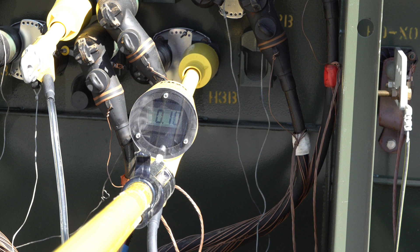If the reading on the meter were to oscillate between a high and a low reading, this would indicate that the cable is incurring a flashover every time it is attempted to be charged. This would also be considered a bad cable. If your utility would like to develop a pass-fail criteria, it's important to remember that on a PD25, every 100 volts is equal to 2 microamps of leakage. That way, if a reading is higher, you can actually determine how much leakage a cable has.